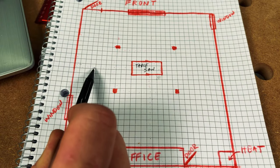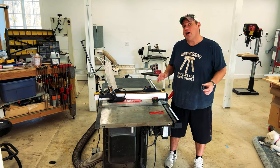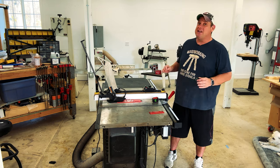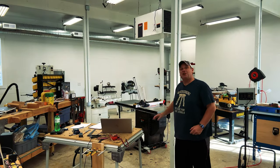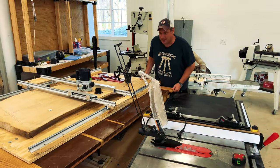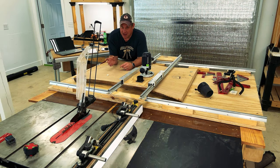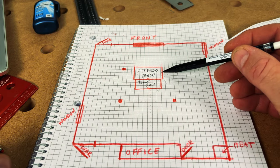I can also do this for its relative position to the other walls as well. If I count the boxes on the left-hand side of the table saw, I know there are 11 boxes, so this needs to be 11 feet from the side wall. Here's the placement of the table saw — I've measured everything out and confirmed it with a laser distance meter. Hopefully you can see that the table saw is directly in the center of these four pillars. Now that I have my table saw in place, it's time to put the outfeed table right behind it. I've placed my outfeed table to scale on my drawing.